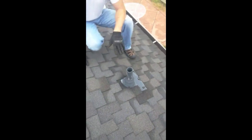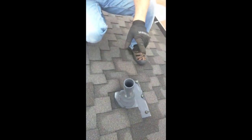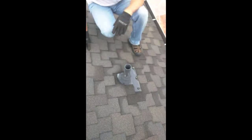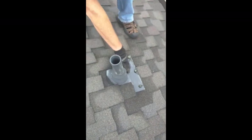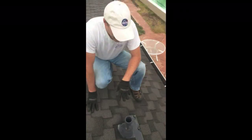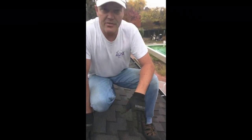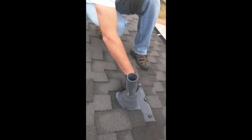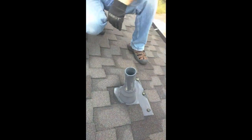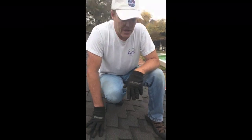This is a two-inch jack that I want to move. The Solar Roof Jack company only supports two-inch and one-and-a-half-inch roof jacks. The first thing to do according to the directions is remove the flashing, but I actually talked to the inventor because I was concerned about making this section of the roof less waterproof by removing all the nails in the flashing. Instead, I decided to cut around the base of this so it's smooth and flat underneath, leaving only this hole, then slide their flashing up on top of it. The inventor confirmed that was fine.